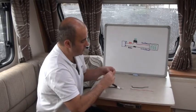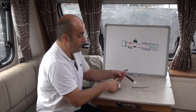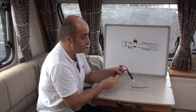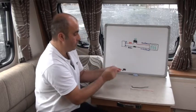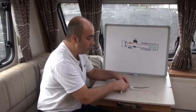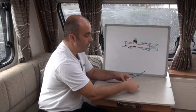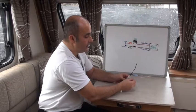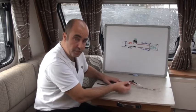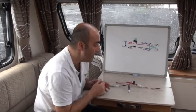So the live goes through and the earth is connected. Take the live going off to the consumer unit and simply snap that together, then do the same with the earth — it should just plug in nice and simply. What you've got is: coming from your battery box, the cable goes into the T, supplies power to Flow, and then continues off to the consumer unit. The cables are heavy enough to carry whatever power you're putting through. Very convenient, very straightforward.